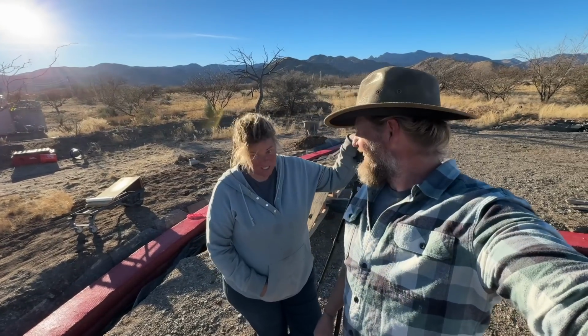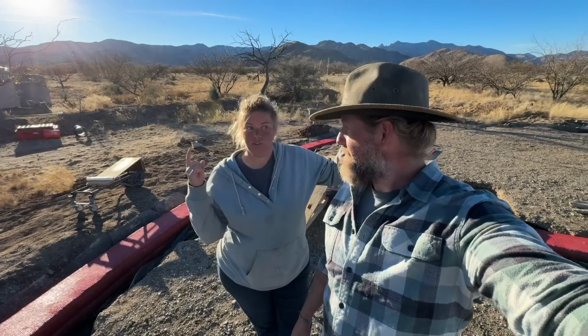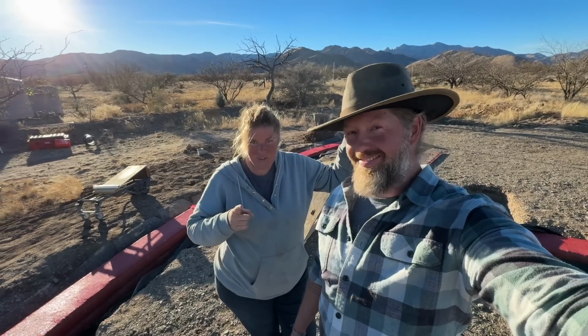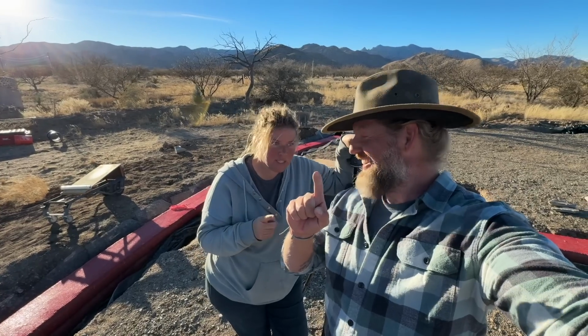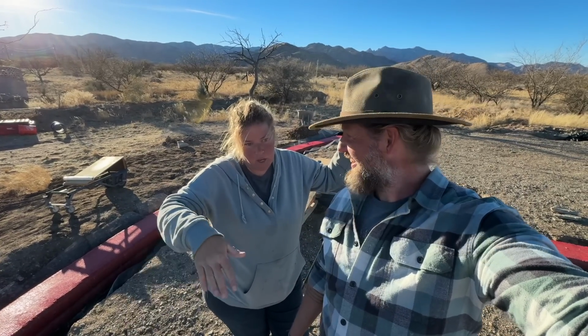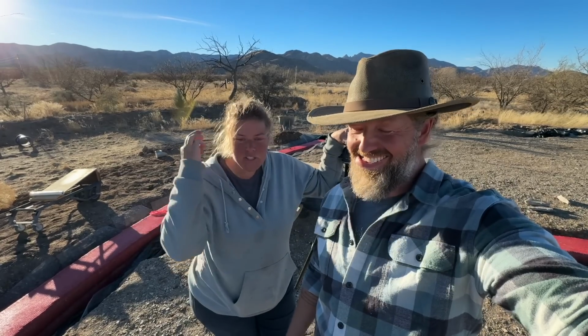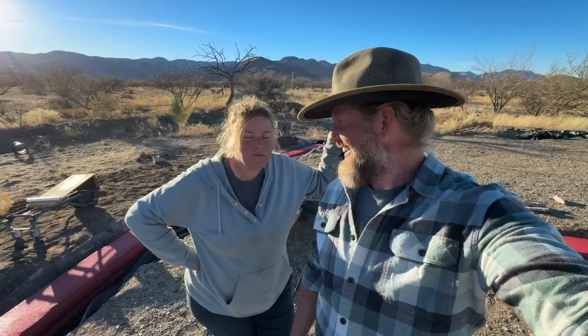Living room wall, course 3, is done. Yeah, it's very exciting to see it. It's above ground level. Next up, we need to do the outside of the kids' bedroom wall, like all the bedroom walls, because we need to build a third ramp. One more ramp. But this ramp is complicated because there's a 2.5 foot drop off the side. We're going to have to figure all that out, and also figure out where the door is. We'll get to that soon. So let's just concentrate on finishing course 3: the outside wall, the hallway wall, and then the inner courtyard wall. Then we'll talk about complicated stuff.